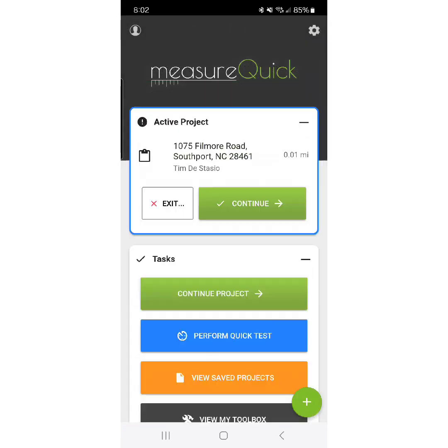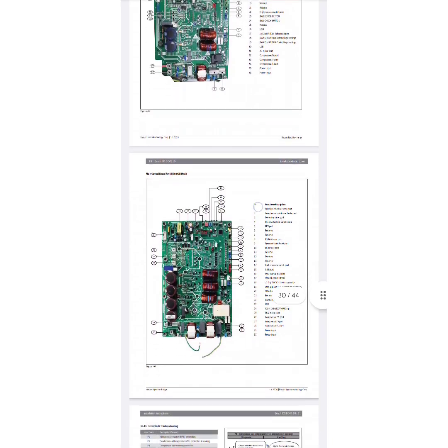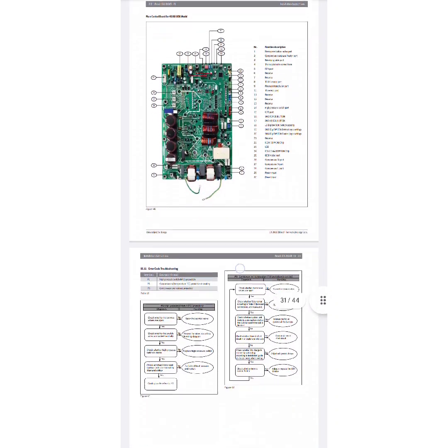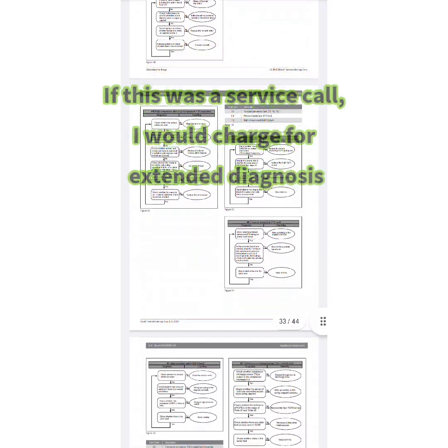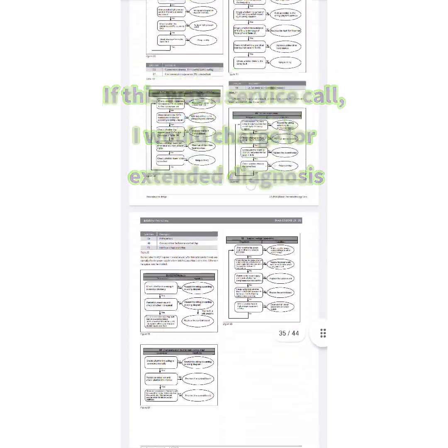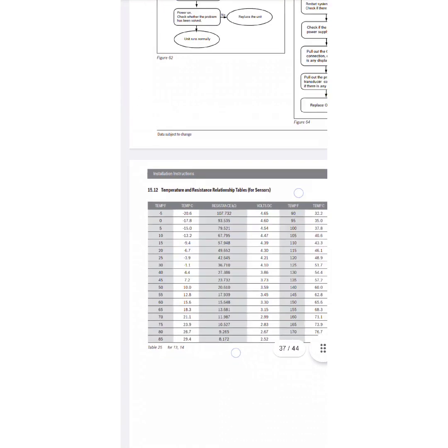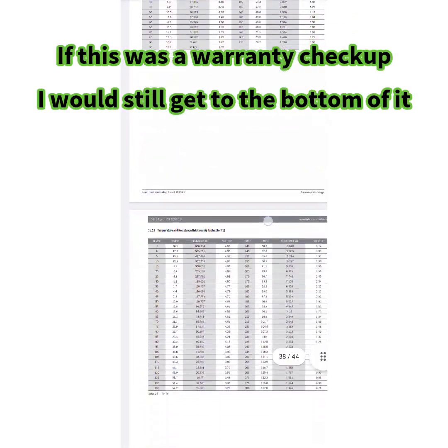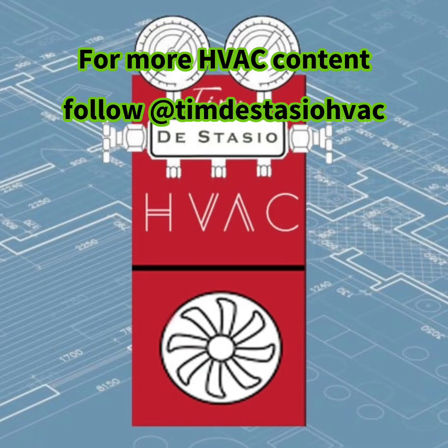I've got some work to do about that zero degree superheat, but so far very impressive. My very next step is to go through the installation manual and get familiar with it again — paying attention to thermistor electrical readings versus what the actual temperature readings should be. This may be something as simple as a thermistor being off calibration, or it could be one of my smart probes being out of calibration. I'm going to get to the bottom of that, and you can be sure I'll have a video on that at a later time. Thanks for watching, and as always, be safe.